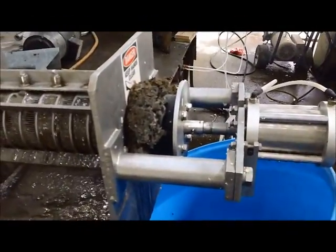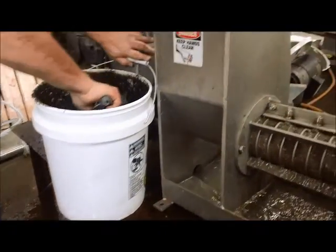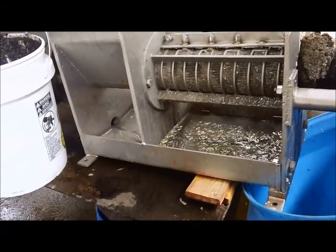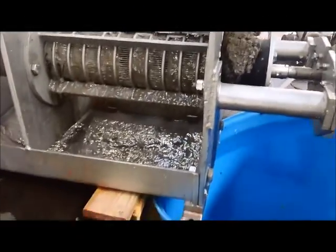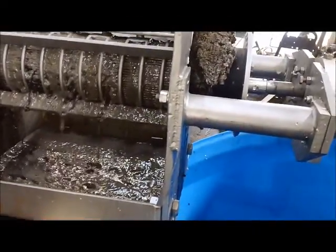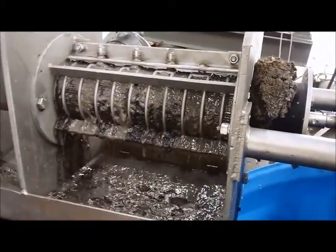Well, we have an empty inlet hopper. We have the ground wood fiber at the discharge. Now this is the settled solids. They seem to be muddy. There's the darker color starting to come out. That actually looks like some thinner liquid coming out. Still the black stuff, but it might be this free liquor that's in here. Yeah, there is free liquid there.